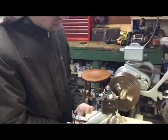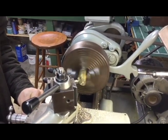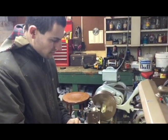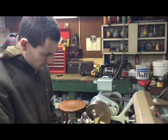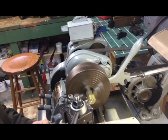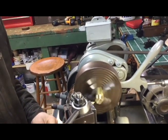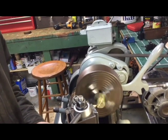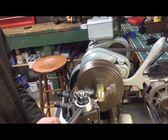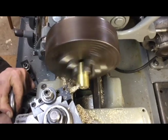As you can see, we're cutting the bar stock. We've got it fixed eccentrically in a four-jaw chuck. Right now we're turning a piece of cylinder stock, holding it eccentrically, and we're going to make a 90-degree pipe elbow with some special threading. It's going to have male thread on one end — 7/32nds 40 model engineering thread — and a female 3/16ths 40 model engineering thread on the other end.